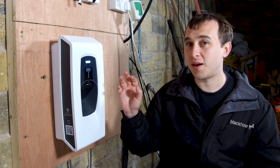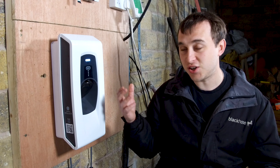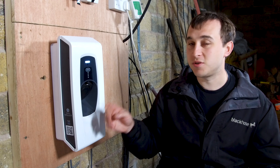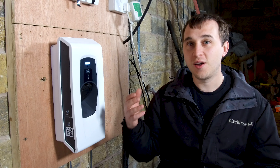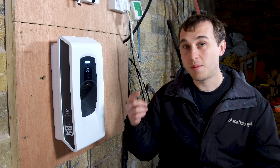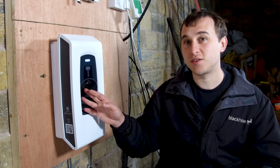PEN fault is a serious safety issue and all EV chargers are required to have it. This is the only charger I've reviewed so far that has two options for PEN fault protection, meaning as an engineer you will have two choices of the way you install it. One option is an earth electrode reference - not a full earth electrode, not several earth electrodes, but just a reference earth electrode near the charger to get an earth reference, which is enough to know if the charger needs to trip.